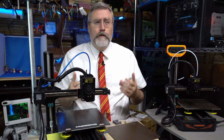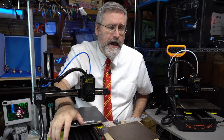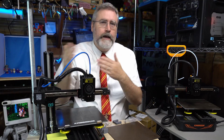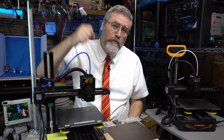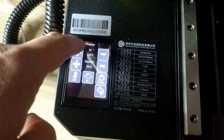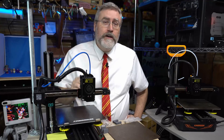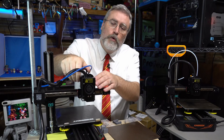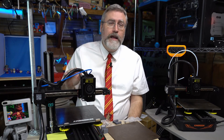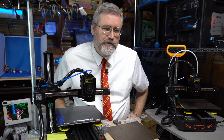But there were other things about the KP3S that I did overlook. Like the fact that when you loaded filament in it, there was no procedure on the fancy touchscreen for loading. For many 3D printers, you say you want to load filament, and it automatically heats up, then says okay now stick it in and it pulls it in. None of that on the KP3S. What you did instead is go to the menu, go to the extruder nozzle temperature, and press plus repeatedly until you got it up to 200 degrees for PLA. Then when it got up to temperature, you shoved the filament in by hand, releasing the pressure on the lever and shoving it in until it went in. This isn't that difficult to do, and once you learn how to do it, really, it's fine. But it was something that could have been better with a loading script.